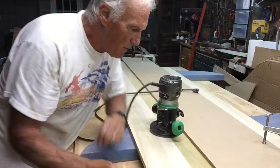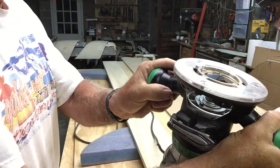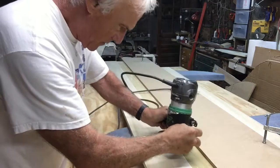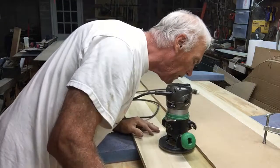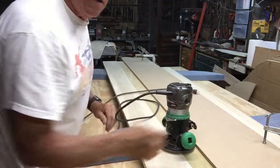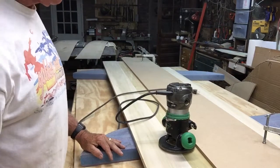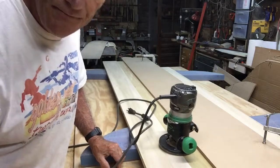So I've got set up here to make the vein. Right here, I've got the veining tool. It's a little V-groove. Pretty straightforward to set it up. I set the exact point on the seam. Did that on both ends. Clamped it up with my C-clamps. And ready to plug this in and make the first cut.